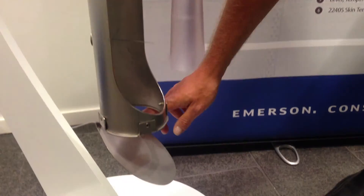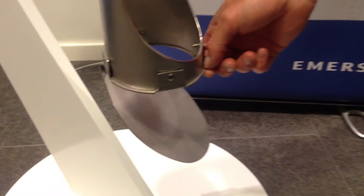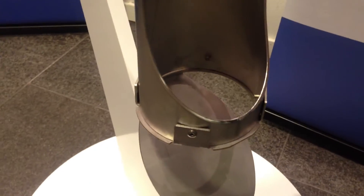At the end of the pipe, we place a deflector and a little reflector ring to give a reference echo, or a verification possibility also from the zero position in the tank.